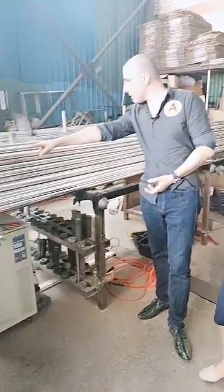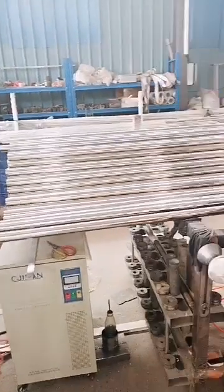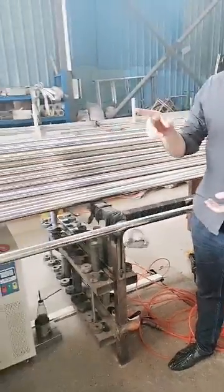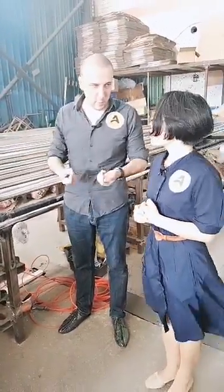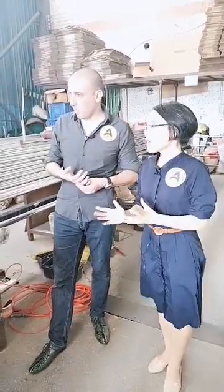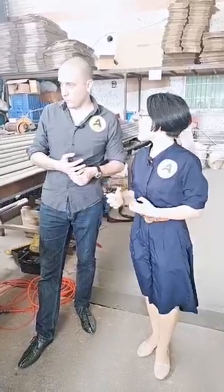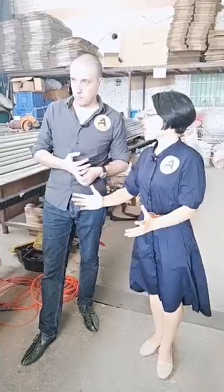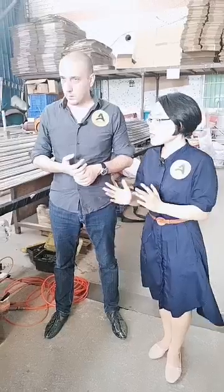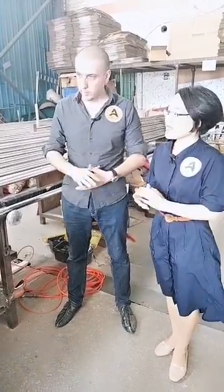And there's a chiller. I will show you later. Because this is a laser, it must get hot, so that's the reason why you need to cool it. All fiber laser cutting machines must connect with a chiller for cooling down the laser source. As you can see, this is just our first generation, an entry-level model of our products. So this machine is just for one operation, just cutting. Yes, always like this. Okay.